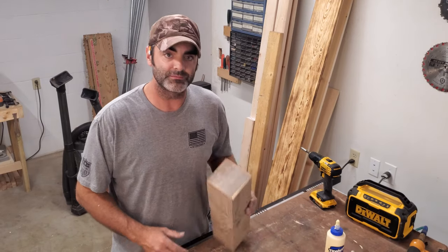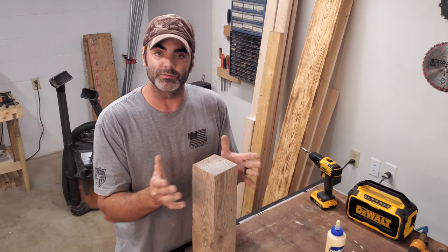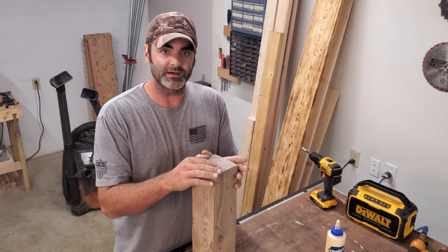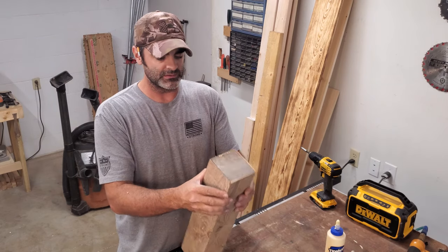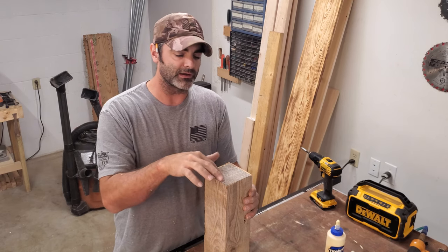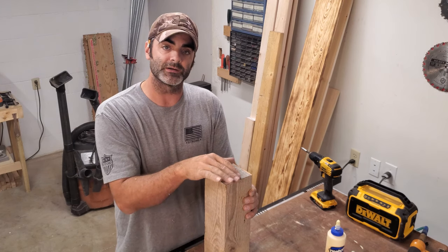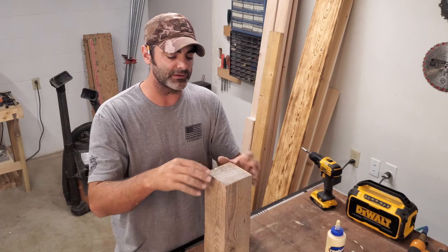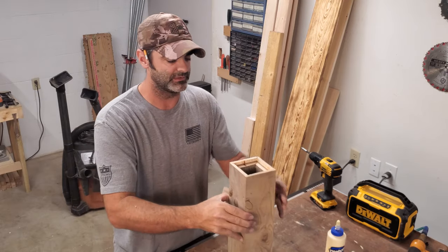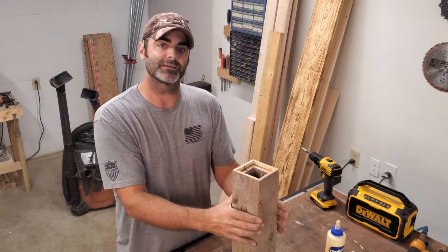One of the problems I continue to have with the barn wood is that it's pretty warped, and I don't want to run it through a joiner or a planer and plane off the weathered surfaces. So sometimes you just gotta go with the flow, and in this case, the end cap is a little crooked, barely, maybe a 16th of an inch. But what I did was I went back and undersized the end cap, and I went about 47 degrees on the cut instead of 45. That way the edges get a nice clean fit. And when I do the sanding, I'll come back through here and sand off these sharp edges. It'll look perfect. Now that this is all together, let's make the top cap, and then we can start doing a little finish on this and putting it together.